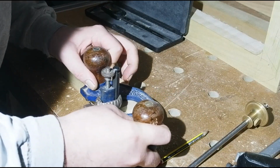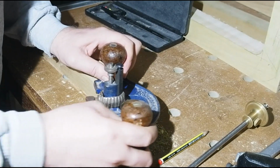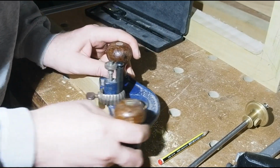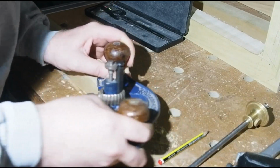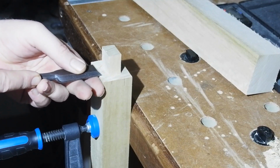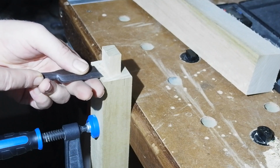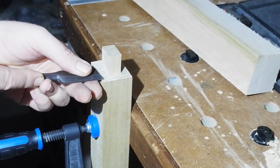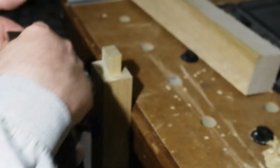Here we are then, final sizing the tenons. I'm not after a glassy smooth tenon here, just the right size. In fact, unless it's a through tenon where appearance is a consideration, having slightly roughed tenon faces can give better glue hold. Shoulders are a different matter of course, these need to be primo. Despite using the stops on the miter saw, it has left just a slight few wisps where the piece was rolled around and the shoulders cut. A few minutes well spent making these good.